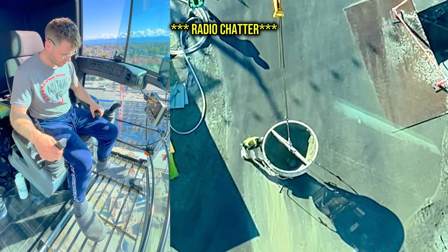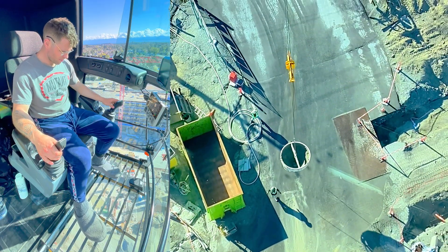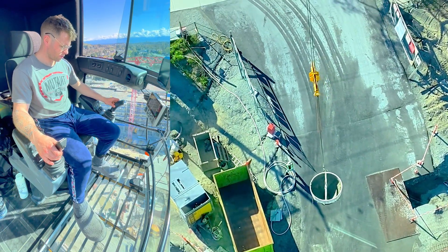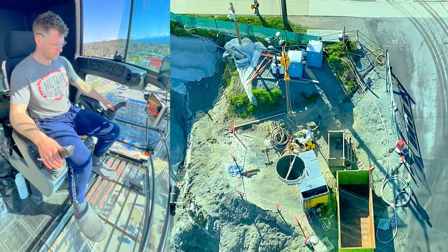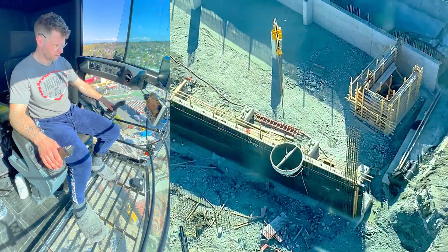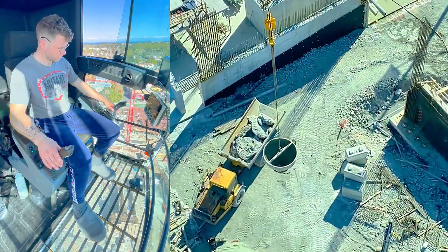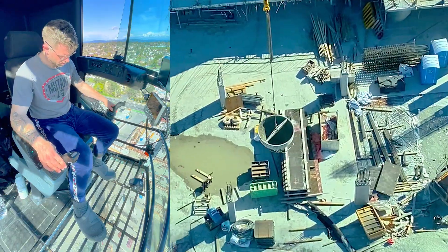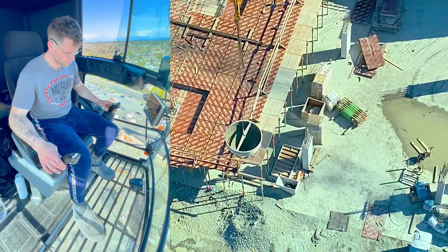Service is going pretty good at this time of the day when they realize everyone wants to go home. The next truck is coming in — my guy was just rinsing the bucket. Even if there's a break between trucks and you let the concrete dry a bit, it can make the chute harder to work with. So it's always good practice whenever you have the chance to spray that bucket off. On this pour we're using the chute essentially the whole time because it's really hard to get the bucket in tight and right over top of the wall. If we're waiting on a truck, let's wash out that chute to make sure the concrete flows nice and smoothly for the guys placing it in the wall.